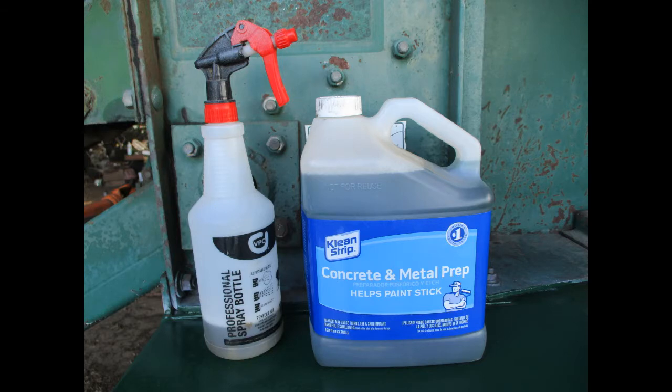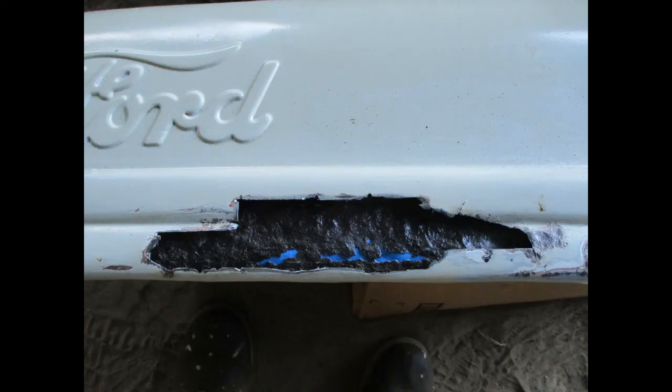Once the metal is clean, phosphoric acid works well to inhibit rust. There's different brands, but hardware stores will have an inexpensive one. We spray the metal, then when still damp, wipe clean with a paper towel. Let it dry overnight. Here is the rusted area cleaned and prepped. Masking tape is used on the back side of the holes so resin won't run out.